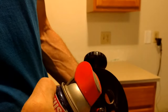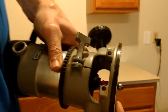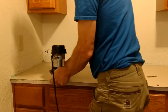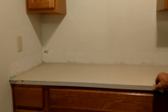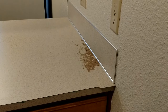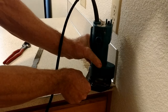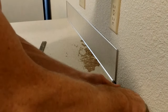I use a half-inch roller bearing and spray a little WD-40 in there to keep it from getting gunked up from the adhesive and dust. Set the depth of the bit so the cutters are just at the thickness of the laminate. Start the router away from the wall because it'll throw off WD-40. Make a single pass, then take a scrap and scrape off the clumps, then make another pass — that makes it a lot easier to file. For the last little tab the router leaves behind, I use my offset router to cut within three-quarters of an inch, then use my ceramic tile nippers to clip it off and hit it with a file.